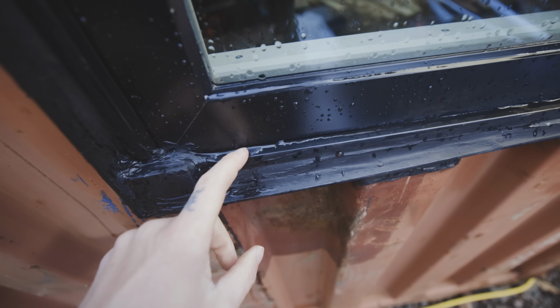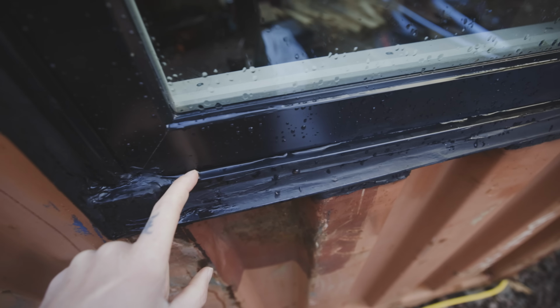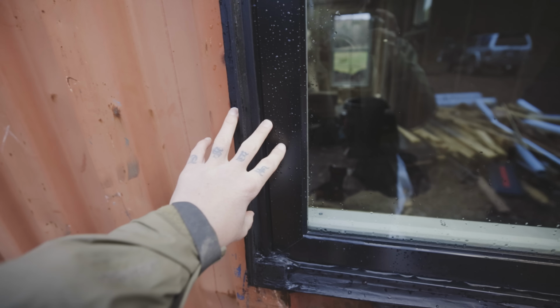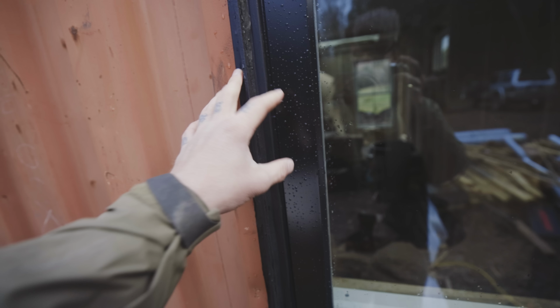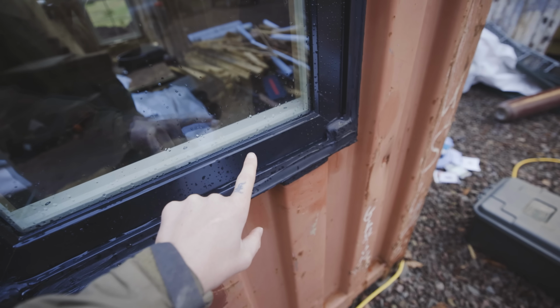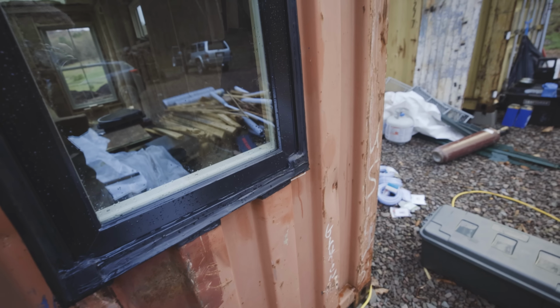We've had a bit of a setback because I think at least 2 of the windows in the kitchen are leaking quite a lot. So this is the window that's leaking. And it seems to be leaking through here, which is like a seam in the window construction. So I will seal this up with some sealant, and I think I'm actually gonna spray a rubber proof coating over almost the entire thing, including a little portion of where the glass meets here, just so that it's fully sealed because the water just pours down this wall. And then I'm also gonna build an awning up there to limit the amount of rain that hits this window.